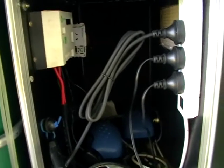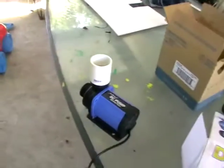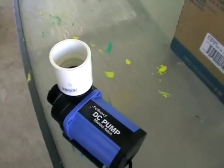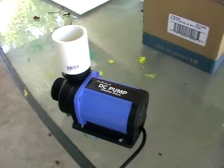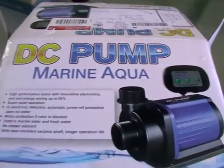I've got a brand-new controller to install which actually lets you set a preference: DC first or AC first. This solar controller will let me go DC first, which means if the batteries get flat from running this all day and all night, the AC power will be my backup — the opposite of a UPS. This baby is going to drain all the solar it wants, and when the batteries get down to about half, it's going to switch off solar and turn on to mains power. Pretty stoked that this works — over the moon.